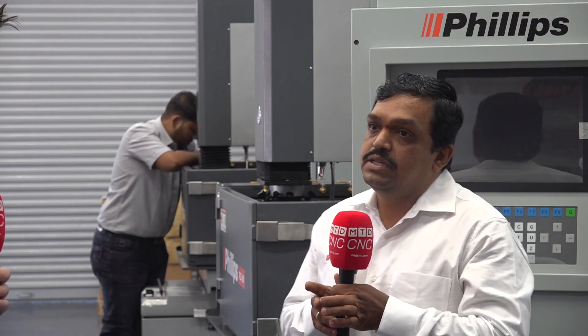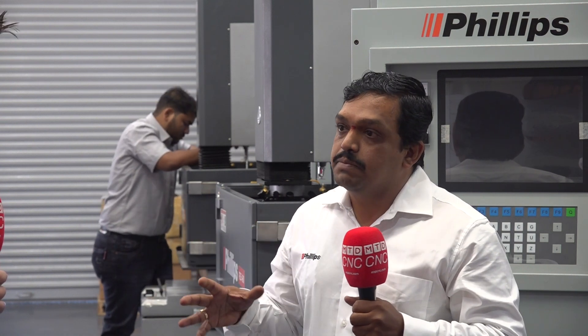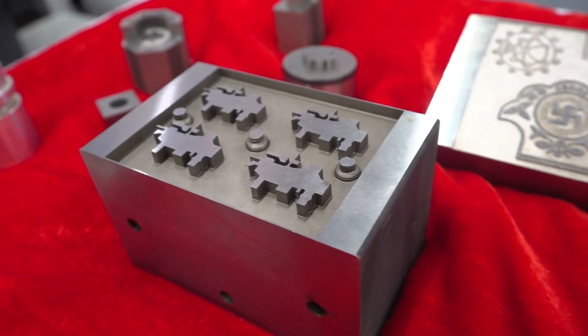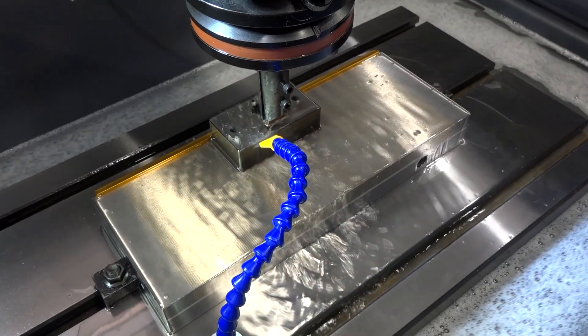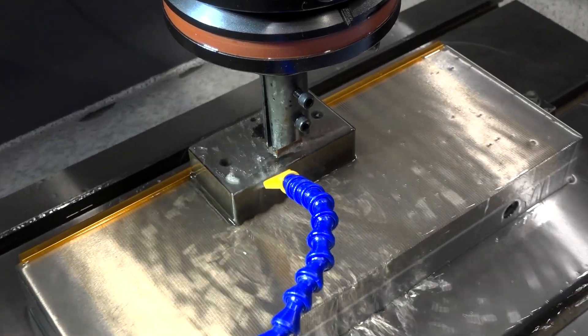Is that correct? That is right. Because in other machines, some product is going to be finished up to 80 or 90 percent, but it will not be 100 percent until the usage of EDM, especially in plastic moldings. For example, if you have done some molds on a VMC, the cutter marks and cutter radius will be there in the corner — it cannot be totally sharp. If you want to make it totally sharp, you should use some electrodes and make it sharp by die sinking.